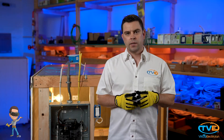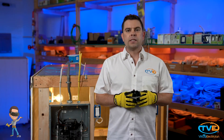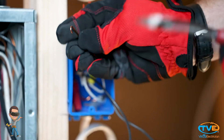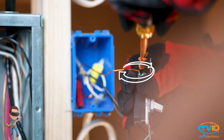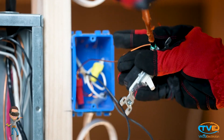So now we're going to hook the wires up to the switch. Take the ground wire and wrap it around the ground screw. You can take your pliers or dikes and bend the wire into a loop. Now, you always want to put the loop on the screw in the same direction the screw is going to screw in. If you don't, you're working against yourself and sometimes don't get a good connection.